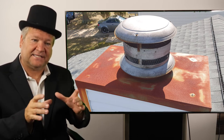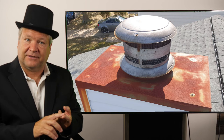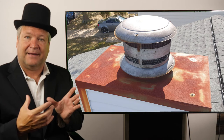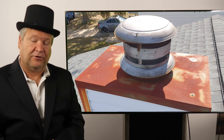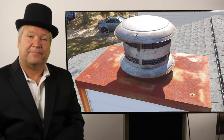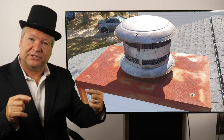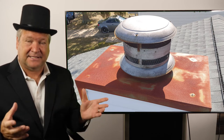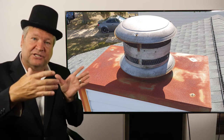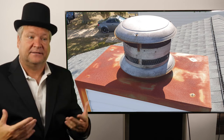So if you have a chase cover that leaks inside of a brick chimney, it will damage the interior portions of the timber structure. You've got this big heavy brick holding on the side, and what can happen is you can have a collapse. If you do have a brick facade prefabricated chimney, you've got to pay special attention. You can't really bolt these prefabricated chase covers on brick chimneys because it just doesn't bolt very well. You've got to measure them precisely, then glue them to the sides and top of the chimney so it's held firm and secure.